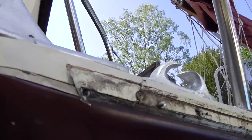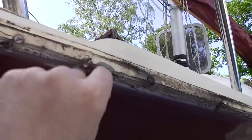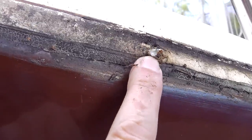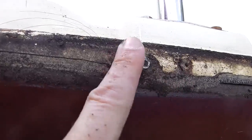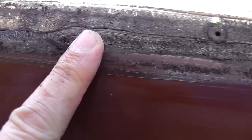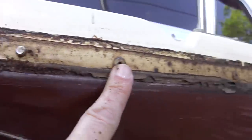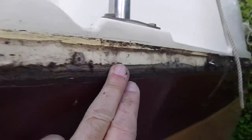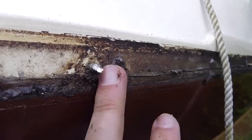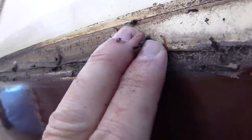The port side has come off much more easily — the rivets are all consistent, we just drill the tops off and then we're able to peel off the rubbing strake. Here's what we found underneath: lots of crumbly old sealant, lots of mud — it actually looks like mud, and it's wet. I'm pretty sure that's just mud and dirt behind there, and it's retaining quite a lot of moisture. The gunge is soaking wet, especially back here. It rained a few days ago, so this has been retaining moisture behind the rubbing strake — eventually it started rotting it, I guess.